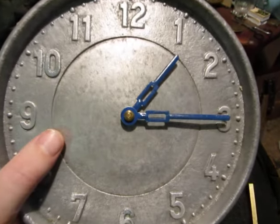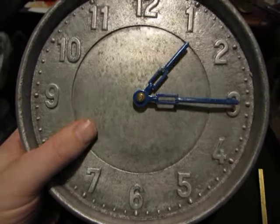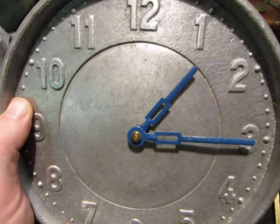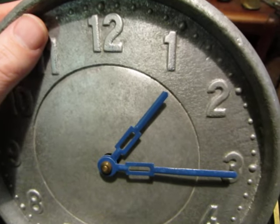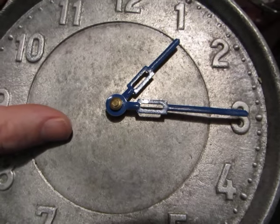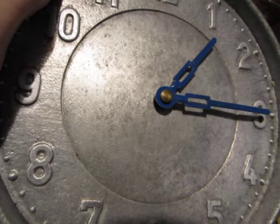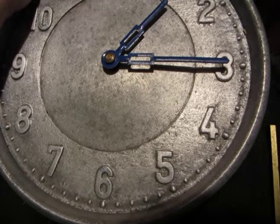Here's the clock close up. Now I ultrasonically cleaned this case — I put it in the ultrasonic cleaner three times because I wasn't sure if it was getting properly cleaned. Every time it came out it looked dirty. It took me a little while to realise that the reason it looked dirty is because of all the tiny imperfections in the surface of the metal. All of which were creating tiny shadows and making it look dirty from some angles, because the entire surface is extremely rough.